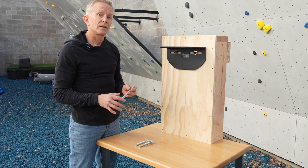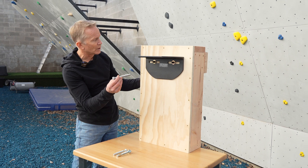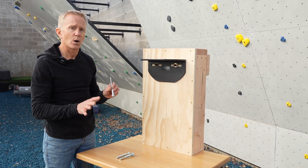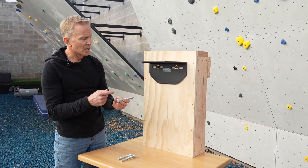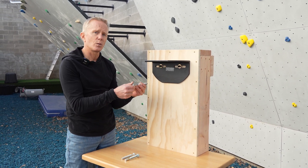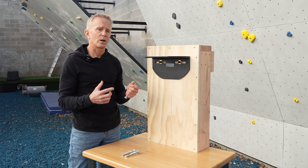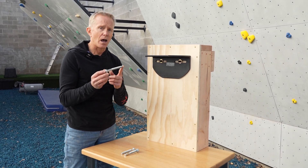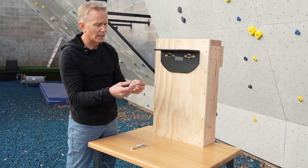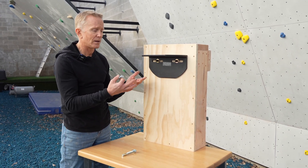The most common hardware question asked is: can they use a lag bolt? A lag bolt would go into solid material — this is not something we recommend, ever. This is a no-go. We only recommend through bolting. We don't know where the lag bolt is going, and we also don't know if you've broken it inside the wall. This is a life-saving device, so unless you're 100% certain of your hardware, you shouldn't use it. I will never recommend a lag bolt or a Tapcon bolt. Sure, you can get the right diameter, but the pullout strength is not something you should ever rely on for a life-saving device.